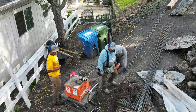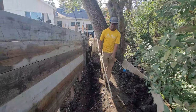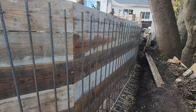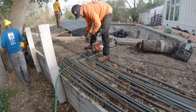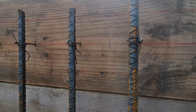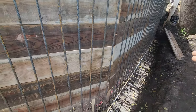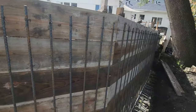We got the guys on the top side cutting and bringing them down — got Joe Johnson right here, Mr. TikTok himself, making his mama so proud. So we got the vertical rebar up here. The verticals for this wall are six inches on center, number five. But each one of these verticals had to be a custom cut — you can see we got 28'4s, 28'6s, 28'7s, 28'8s, and so forth. That's just the way the slope of the terrain is, so we had to make each one a custom cut.